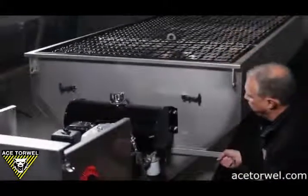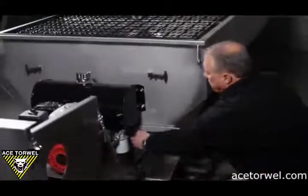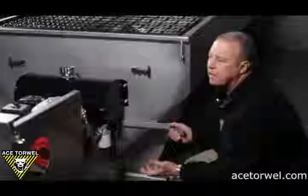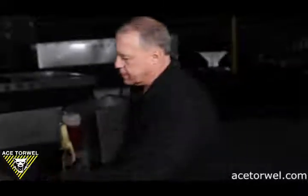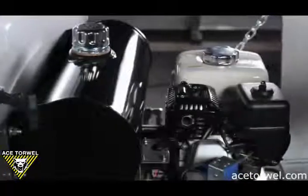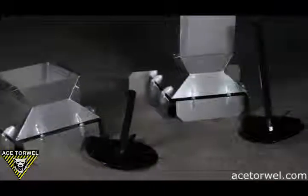As part of the hopper assembly we include an adjustable gate to the rear of the hopper. This allows for just a release of the lever nut and an up and down motion to either close the gate for less material flow out to the spinner disk, or open the gate for more. Included on all of our economizer models except for the hydro spread are hoods that protect the engine gas tank or hydraulic tanks on any of the units, so that sand and foreign material don't get inside or poured on top of the engines.